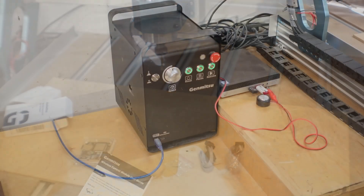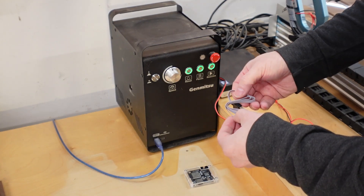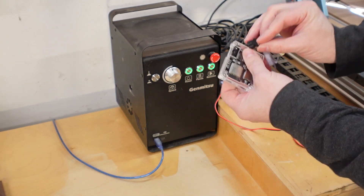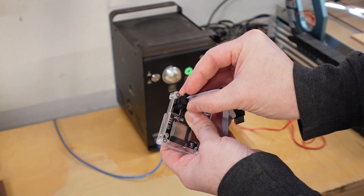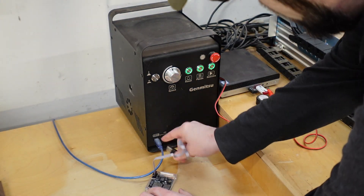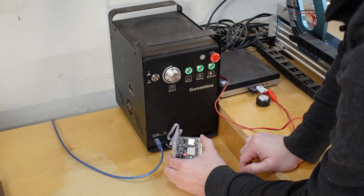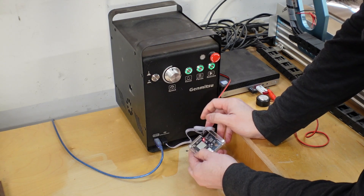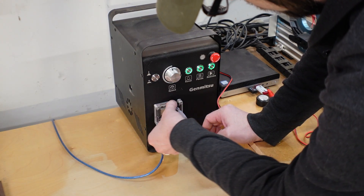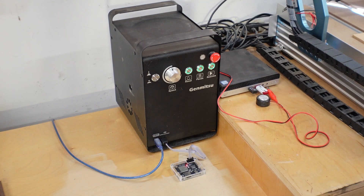For the 6050 Plus, installation is very simple. We've got our wireless module and the USB — they're calling it a JTAG cable — which has a pin that aligns the module to the plug. You just plug that in, then simply plug this onto the front panel's USB connection to the offline controller, get it in the right orientation, plug that in, and it lights up. We'll need to figure out where to mount this — maybe on the side to keep it out of the way.